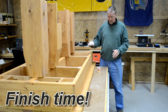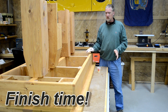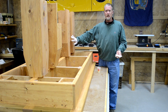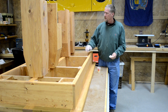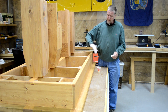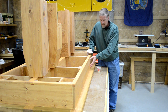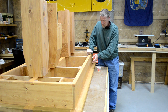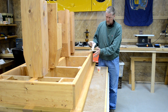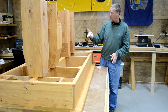Things are moving along wonderfully here. I've put a coat of stain on the frame itself and on the legs, and the color I chose is Ipswich Pine. It's a stain that's been around forever and it basically makes a piece of pine look like it's been sitting in the sun for 10 years. On the legs where I used the framing lumber I put one coat of stain, and on the sides of the table and the veneer of the legs where I used the number two stock I put two coats. These areas were quite a bit lighter than the framing lumber, so the two coats made them look very uniform — and they look really, really nice. I'm very happy.